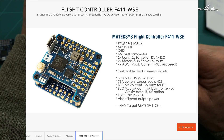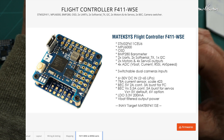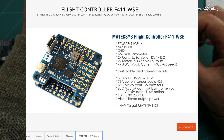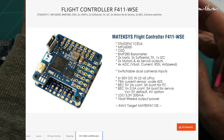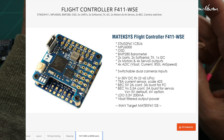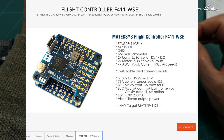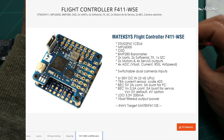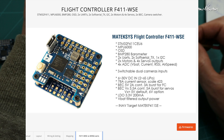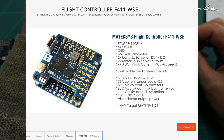Now some of the specs: 2 UARTs, 2 soft serial, 1 I2C, 2 motors, 4 servo outputs, 4 analog-to-digital converters for VBAT, current, RSSI, and airspeed. Switchable camera inputs, voltage input 2S–6S, 78-amp current sensor. For the BECs, there's a 5-volt BEC for the flight control board and a variable voltage one — default at 5 volts but you can increase it to 6 volts with a solder bridge. 3.5 amps continuous, 5 amps burst for servos.